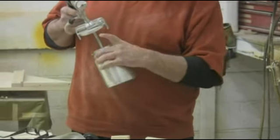All right, I'm gonna let these flash just a little bit. Now the first thing you noticed is I did what's called a cross hatch. Put it on one way, came back the other. One of the things with spraying is get to be a pretty good shot. Now, as soon as this flash is off, which this shellac dries pretty fast, now I wanna tell you something.